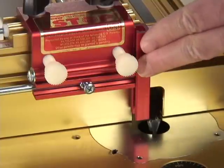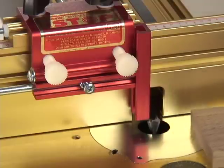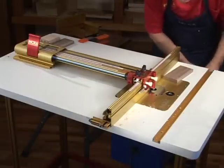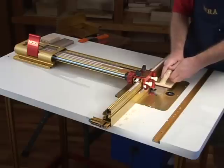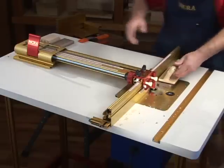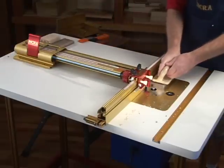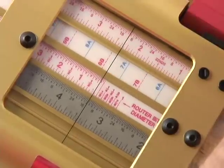This stop setup will always produce a socket that is a little short, so we'll only cut one end of one piece at this time, then adjust as necessary. Move the stock into the cut until you just touch the stop arm. Don't force the material against the stop. Now move from B cut to B cut until you've cut across the full width of the material.